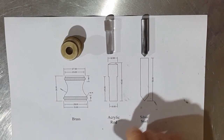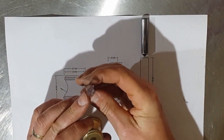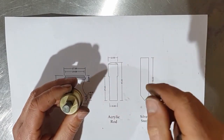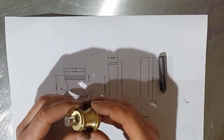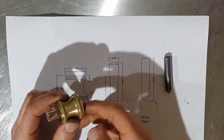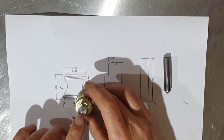Well, that's all the parts made for the optical centre punch. So we've got the main body, and then we've got the optical viewfinder with the crosshairs in the bottom, which slots in there, and obviously the punch for then punching our centre punch hole. So how this works is the acrylic rod absorbs light and allows you to see right down to the bottom, even though this is obviously dark when it's sitting on something. It does absorb light, which I'll try and show you how that works.